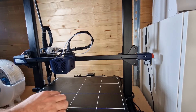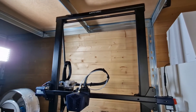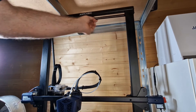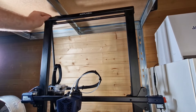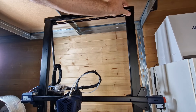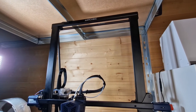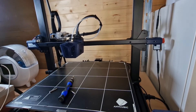Check your extruder - make sure the motor's not vibrating loose. At the top of the machine you'll also notice another belt - check that for any damage as it's really just for timing. You also have some brackets at the very top of the frame holding ball bearings - check those are all in place and haven't come loose.